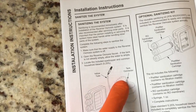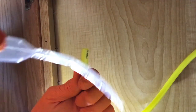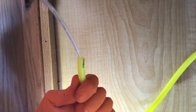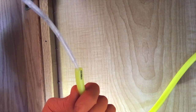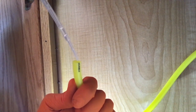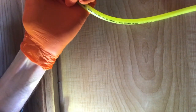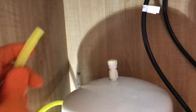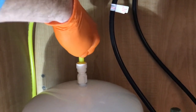In the previous video we did not connect this yellow tube, and that is why. Going down below: I've got the hose in position and the eyedropper. I slowly insert the end into the cup, squeeze it, and pull the bleach into the eyedropper. One squeeze gives one milliliter — insert that, give it a couple squeezes. Do it a second time, and a third and final insert. You may have bubbles, but that's okay. Allow the bleach to go far down into the tube — don't let it rest in the bend. Carefully reinsert the yellow hose into the connection point and push down until it is firmly connected.